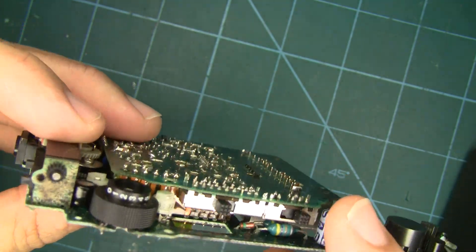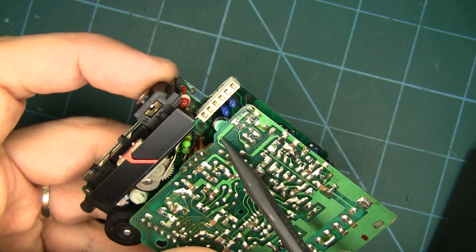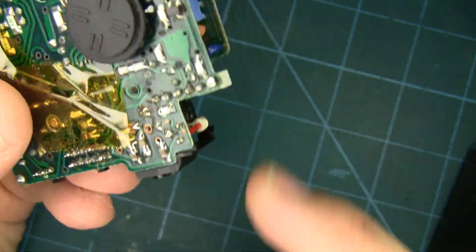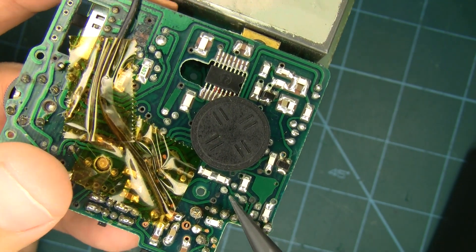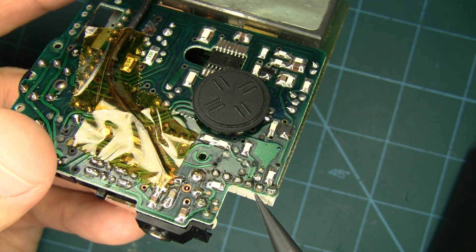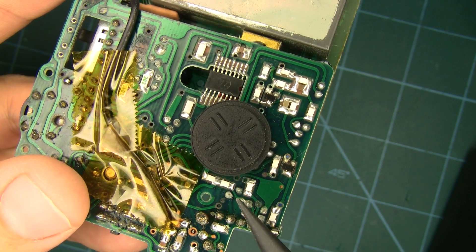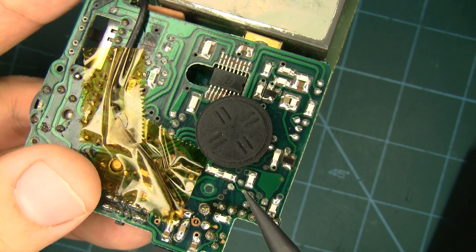The second type of corrosion is due to age: some electrolytic capacitors start to leak, and when they leak they have their own corrosive signature. For example, looking at this capacitor on the opposite side, you can see that these two solder points — the legs of that capacitor — are a little bit dull compared to the nice shiny neighboring solder locations. Many YouTubers who fix electronics mention this as a corrosion typical of capacitor leakage.